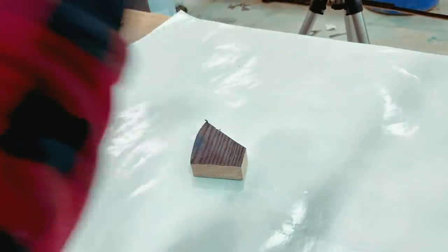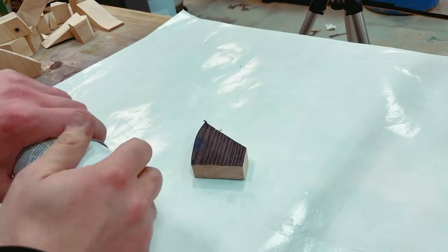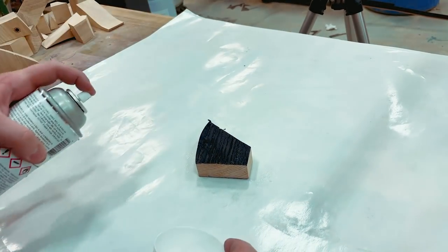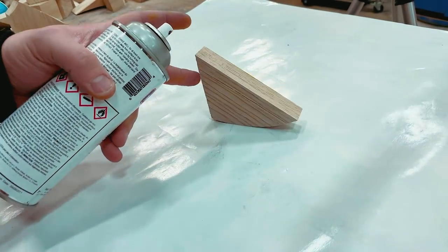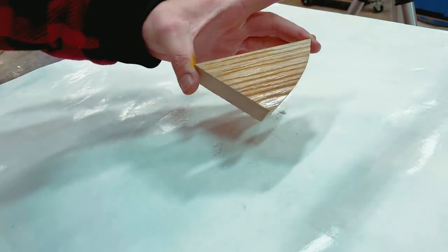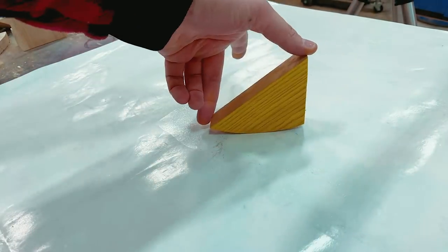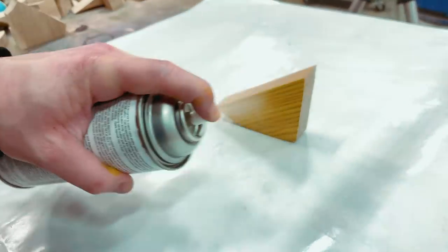Now I'm going in with my sealer on the side that is fully dyed. This is kind of the opposite technique — where you dye something, then spray it, and then go in and push a different color into the grain afterward. We'll discuss that in more detail in the next video, but I just want to light coat a sealer there because I don't want to seal up the open grain. Similarly on my sandblasted piece, I'm putting some sealer on there to protect the closed grain so I can push something like a gel stain into the open grain afterward.